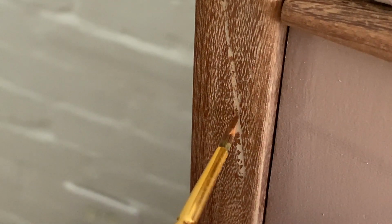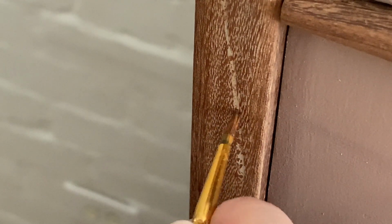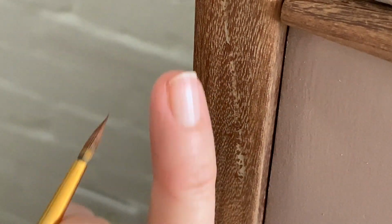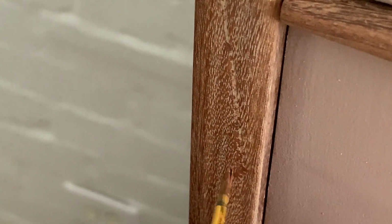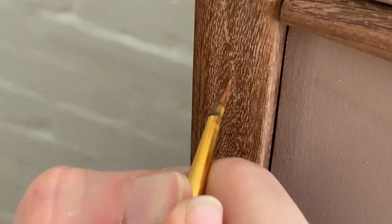But before I actually started painting, I decided to bring our friend inside because I find that I do a better job using inside light whenever I attempt these tiny faux wood repairs. Using a small artist brush and kind of doing a dotting technique, I carefully added a bit of all 3 of those colors to mimic the texture and movement of the teak wood trim.